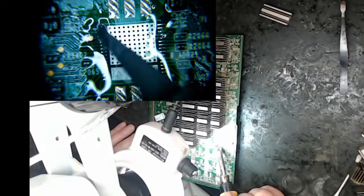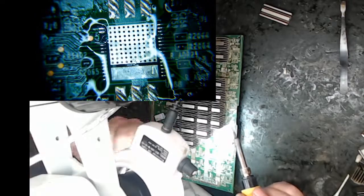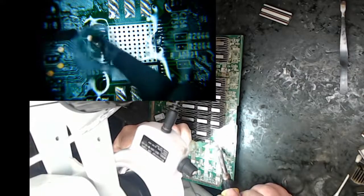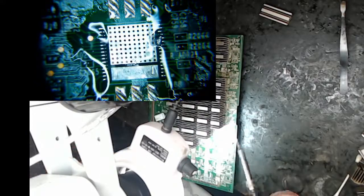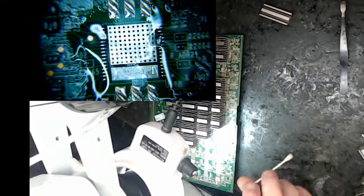And it has some problem there, because there's double leads going out the ground right there. So I usually have to throw some more flux in there until it's right and not shorted. That looks about right. Let's clean that off and we'll inspect it.